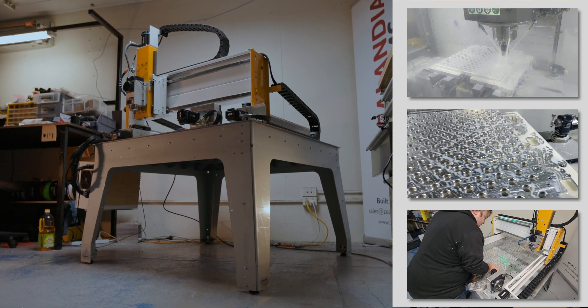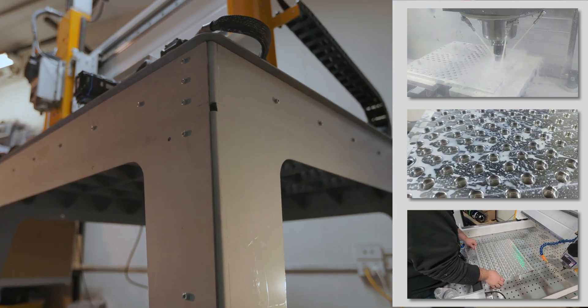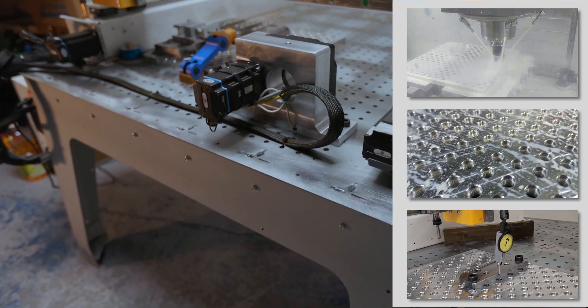With that we have built our steel table, we have machined a fixture plate for the Mod vices, and I can tell you those little vices are amazing. We were hesitant because of the price with the US dollar exchange, but they're second to none — hands down, they are the way to go. We've been running the Saunders vices on the fixture plate with a steel table, running a three-flute cutter at up to two and a half to three metres a minute at full slotting, getting 0.05mm backlash in the machine, and just getting some unreal surface finishes — we're really blown away.